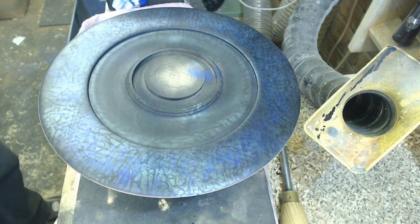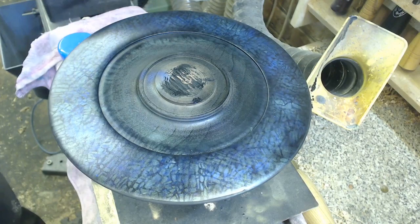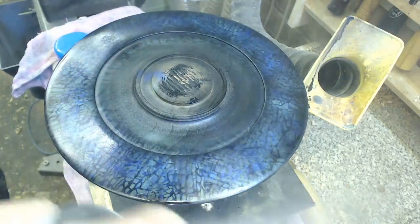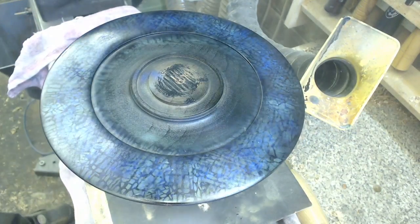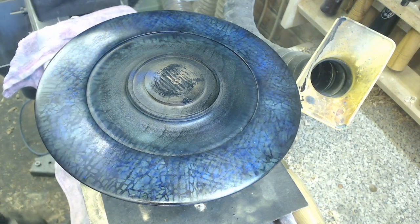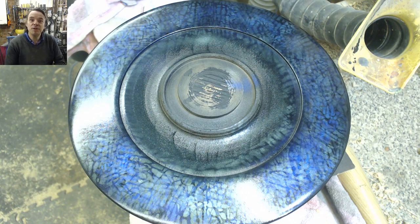Right, sanding sealer. Right, first of 3 coats of lacquer going on. And 20 minutes between coats. Well, there it is, 3 coats of lacquer on it. Time to let it dry, and a bit of buffing in the morning, maybe a bit of burnishing cream, bring the shine out a little more, and then we'll turn the middle out and see if I like it. Until tomorrow, sweet dreams.